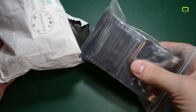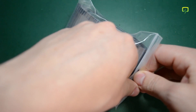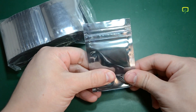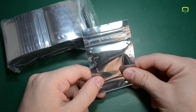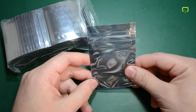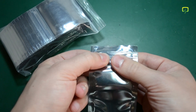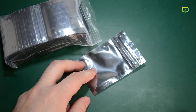Next up, let's see what we have in this envelope. These are ESD-safe storage bags. I got these from eBay — should be 100 pieces and they were about $5 shipped. I will use these to store various ESD-sensitive electronic components. They are zipped so you can easily seal them to prevent dust and moisture from getting inside. Quite a handy thing to have in your electronics workshop.